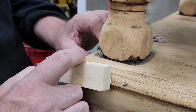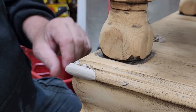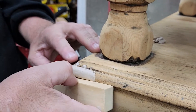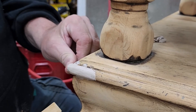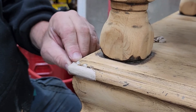You can see me here using the block, just shaping everything in — very simple technique. Now I'm feeling this edge where the moldable epoxy meets the wood. I need it to be almost a seamless transition. It never is when I apply it — I always have to sand it seamless — but I try to get it as close as possible. Now I'm working the opposite corner to try to rebuild that corner.